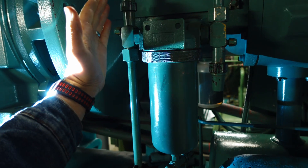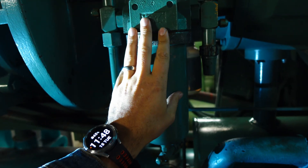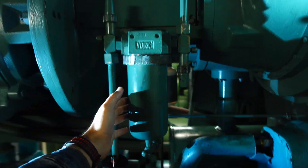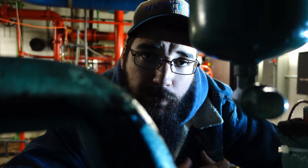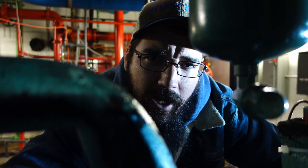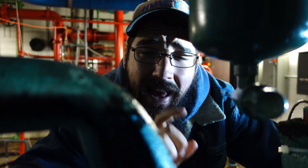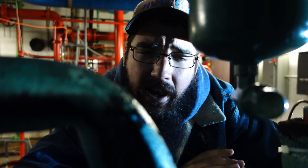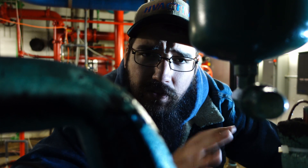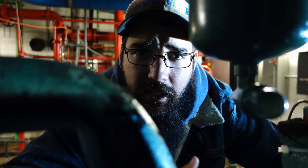Right now their most current standard is change that filter on an as-needed basis, and there are a few ways of trying to verify when that really is needed. The two simplest recommendations come down to pressure drop across the filter — you have two valves here where you can check it, and you can also isolate and change this filter without having to do a complete recovery on the system. The other alternative is whenever you have to do an overhaul or major service. If you ever do an oil change or change the filter, some things you really need to pay attention to are any shavings, metal fragments, debris or particles in that oil. If you're doing oil analysis and changing this filter, it is always really wise to take a piece of that filter, cut it out if possible, and send that in with the oil sample so they can analyze that filter material and tell you if it's catching any particles.